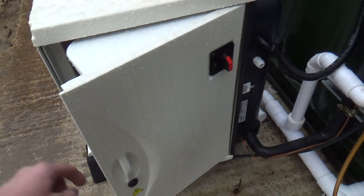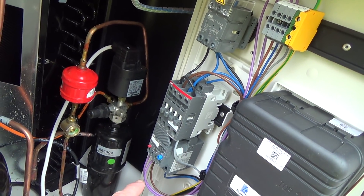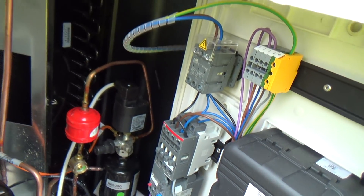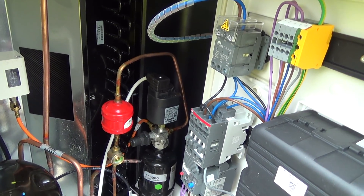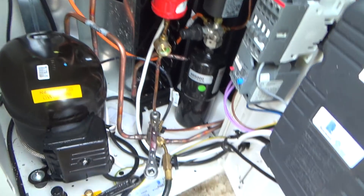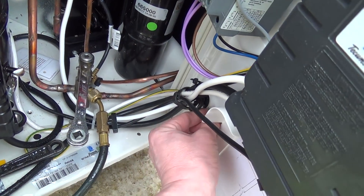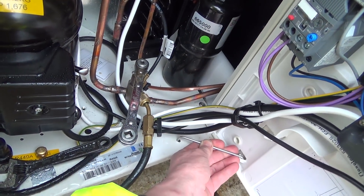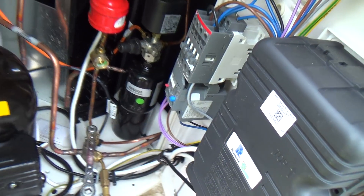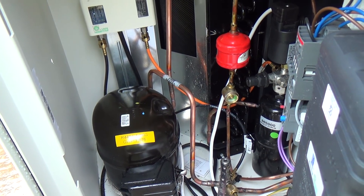They're quite a nice little unit. You've got a little catch here and then the door opens up, and you've got a contactor and a switch. We've put the overloads on there as an extra, because the original Danfoss units we quoted had overloads on - anyway, they're a good thing to have. We've also fitted the fan speed control to keep the head pressure higher in the winter. You've got a little Danfoss pressure switch up there, a compressor with a crankcase heater on there. Service valves are fairly easy to get to. It's only a tiny little compressor - about a third of a horsepower.